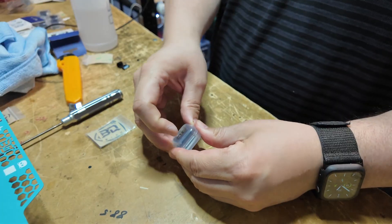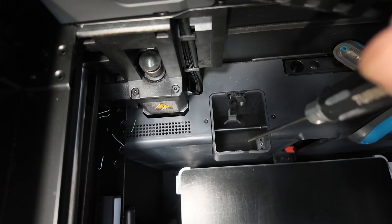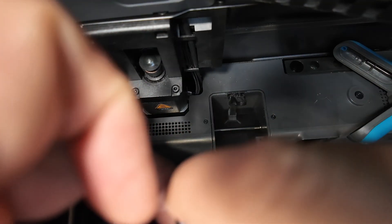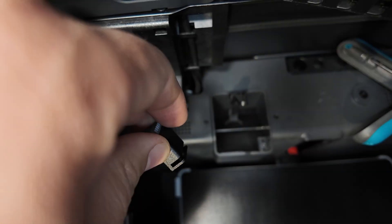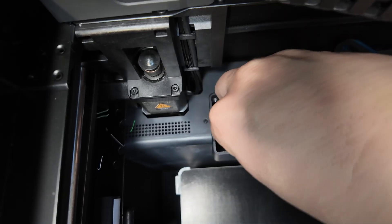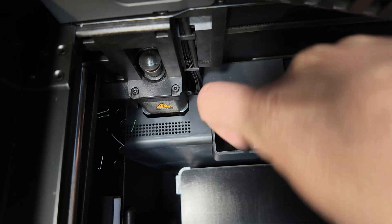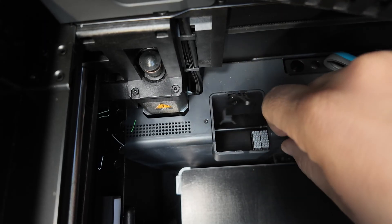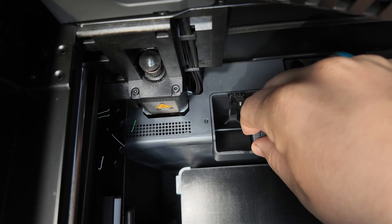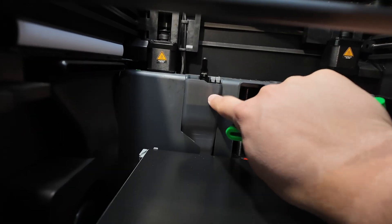That's bonded. So we've removed the nozzle wiper. Now let's put the new nozzle brush in. Down here is the bit that was holding the nozzle wiper. The new one has the slit, and you're going to push that onto there — go down from the top. You can feel it with your fingers where it is; it's just resting on it, quite wobbly. Now you'll hear it click — that's it, it's in. That's not coming off. You can remove them if you need to by pushing them off. And that is installation complete. You can see how much larger that is compared to the original — it is significantly larger.